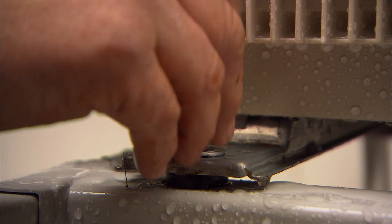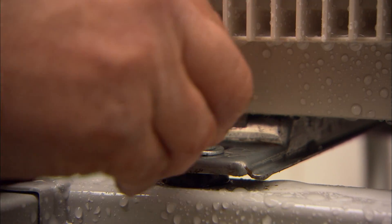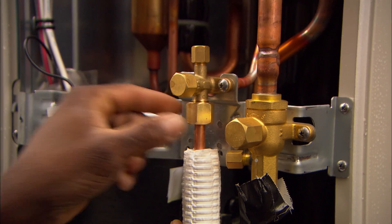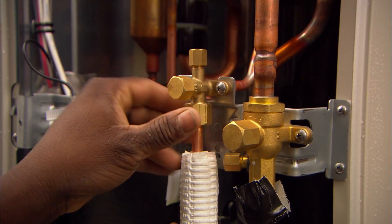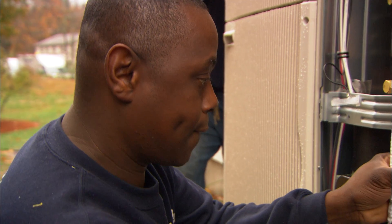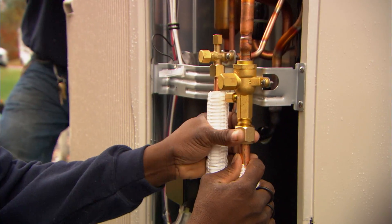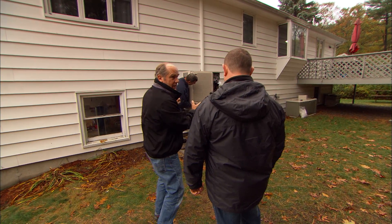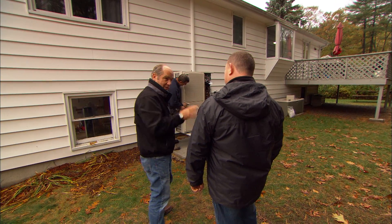Because it has to heat in the winter, they've mounted it on a stand to get it up above the snow line so it can operate even when snow has fallen. Refrigeration linesets are pretty straightforward — one set of larger lines from the unit to inside, so you can see how easy it is to retrofit into the building. When we're done, we're either going to be finding heat outside in the winter and dumping it to inside, or in the summer we find heat inside and dump it to outside.